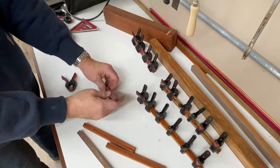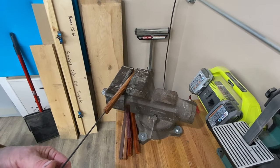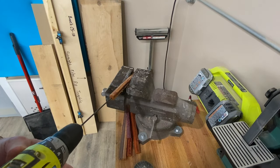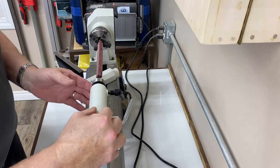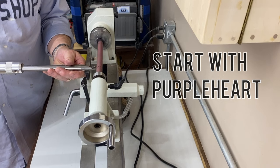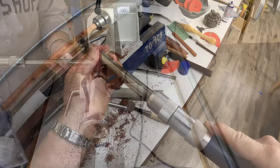After unclamping the pen blanks, I'll spend most of the day shaping the rectangular tubes into something round and smooth on the wood lathe. The last step before turning the blanks on the lathe is to finish drilling out that eighth-inch hole down the center of each blank. Though most of the work will be done on my hobby lathe, you don't need this tool — a little further down in the video I'll show you two different options using tools you might already own. Also, if you own a small wood lathe and wanted a more complex pen project, you can buy two-piece mechanical pen kits to glue your wooden pieces on.